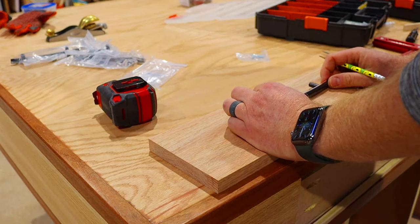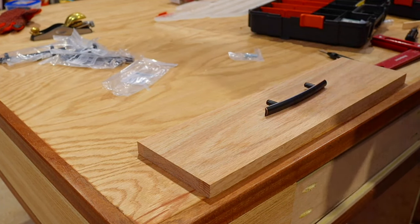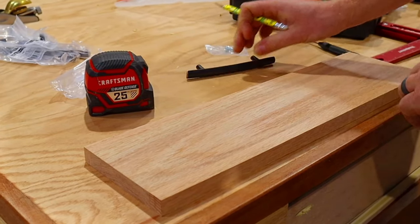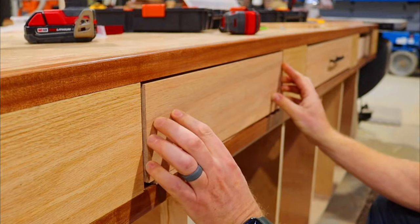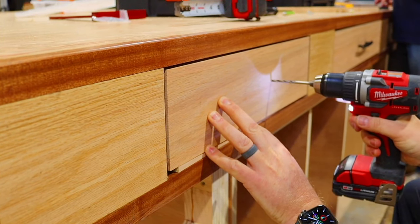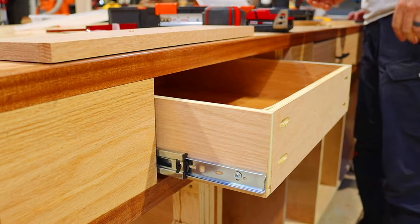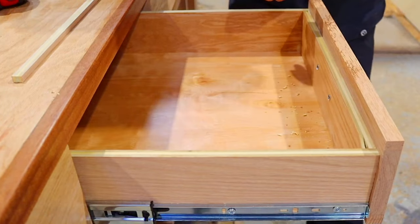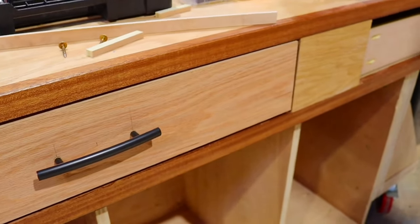Only a few things left to go, which includes the drawer fronts. There are some simple ways of doing this with jigs, but try this one: I place the handle after finding the center on the drawer front, then measure to make sure it's actually centered. I mark exactly where I want my screw holes to be for the handle. I place a shim — approximately a quarter of an inch — because that's the reveal I want all the way around for an inset drawer. Once I'm comfortable with that, I take my drill with the correct bit and drill through the actual drawer front and drawer box at the same time. I then put the drawer handle on the drawer front, adjust it for level, and grab some cabinet screws to screw it from the back for added security. Drawer front is already mounted — no fuss, no muss, no clamps.